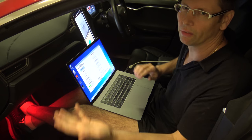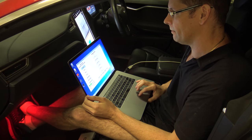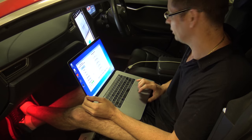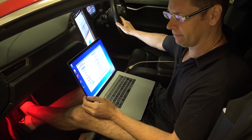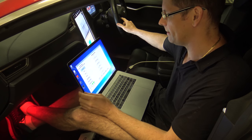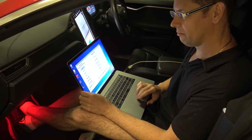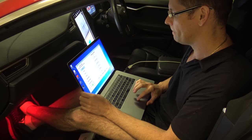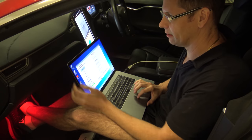You can't hear this very well through the camcorder. It's very treble-heavy up the front. The doors are pretty flat — I think the doors are trying to do a bit more bass than they can handle, so I'll adjust that. The back doors aren't too bad.